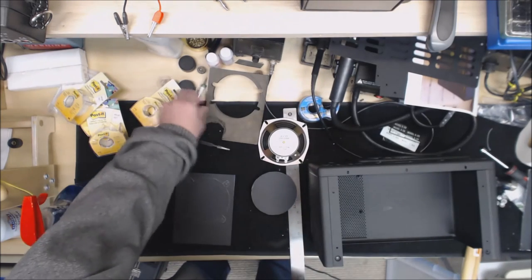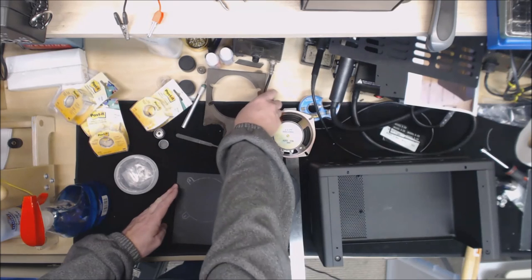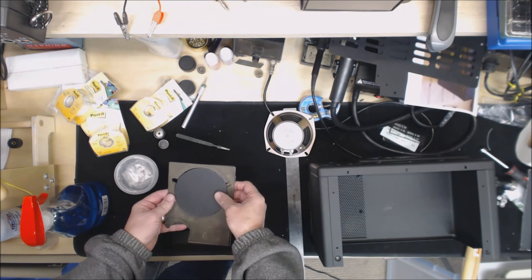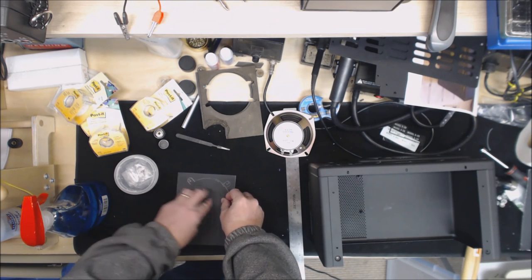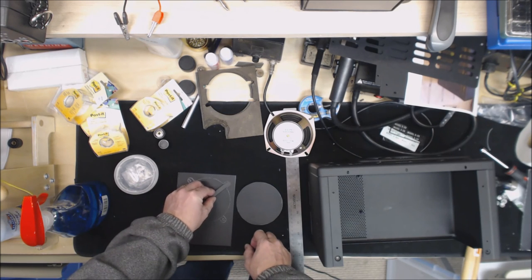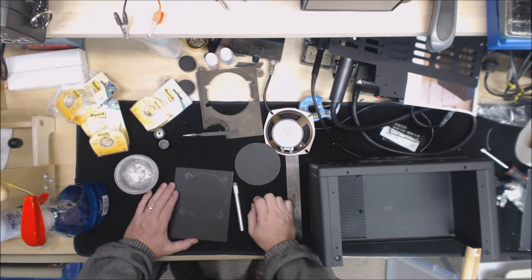Okay, here's what I came up with. First, I laid the speaker over the holes, got it lined up, traced out my mounting holes there. And I realized that the old pattern, it's 4 1/4 there. So on the construction paper, I drew out a 4 1/4 inch blank, centered it between those mounting holes, drew around it. Then for the mounting tabs here, I use the end of a pair of tweezers. It's about the right size.